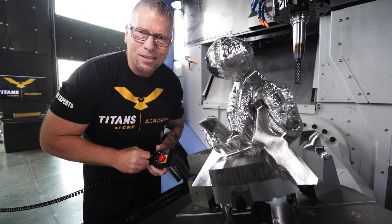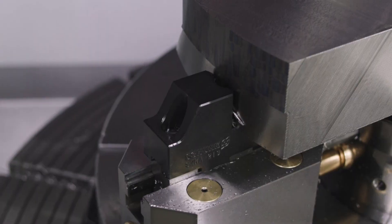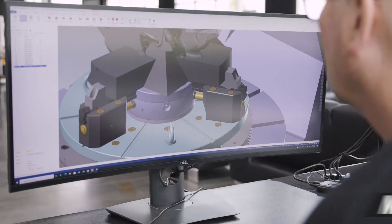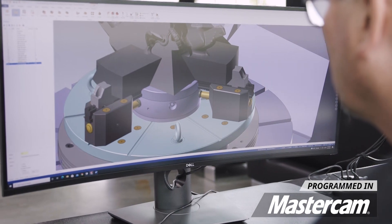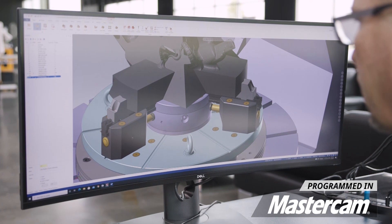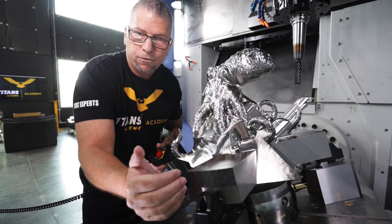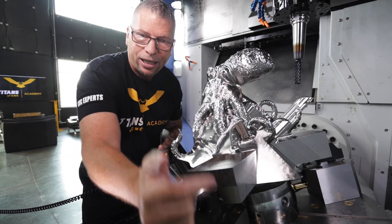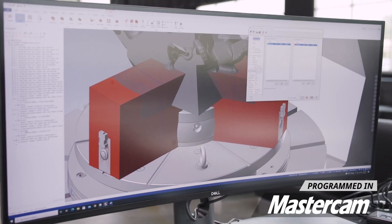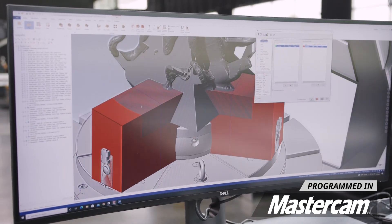When you actually come to the side, you can see the claw jaws digging in, 120 degrees apart from each other. I actually brought the fixture into Mastercam, then I did a C-plane off of this flat right here. Did a rectangle, dimensioned it off the claw jaw, then I created a rectangle, extruded it in past center, and copied it two times, which basically gave me this shape.